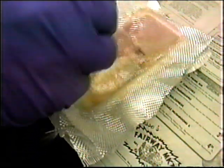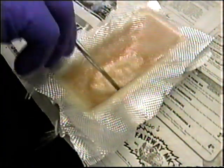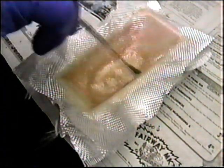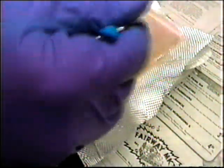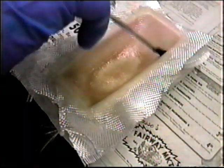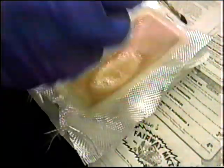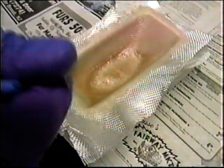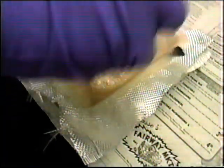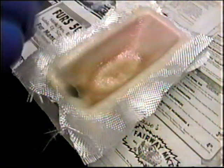So we don't want to add any more resin. In fact, I would like to have a little bit more in there, but it won't matter. We have a little material to sand down. When this is pulled out of the mold tomorrow, we'll grind it on the belt sander, and then it needs to get mounted to a piece of 64th plywood to give that nice straight edge. For a first test part, I think this is going to be fine, and we'll get a look at it tomorrow. We're at the end of this work day right now.